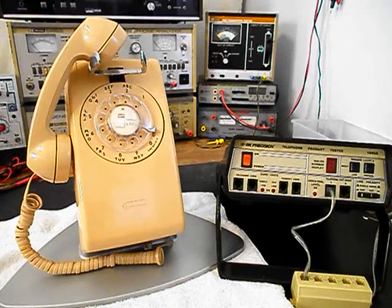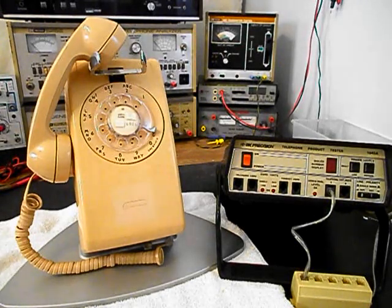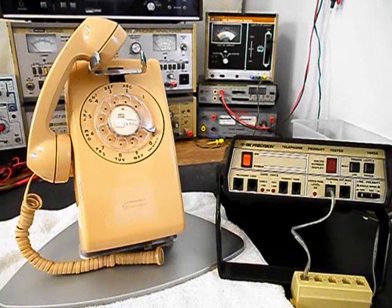We also want to install a switch for the mechanical bell. We will install a switch at the bottom of the unit so Curtis can turn the mechanical bell off and on. We will be setting the bell up for the most ring action. We also need to install a modular line port on the inside of this unit so that Curtis can plug in any length line cord, any color that he chooses, and plug right into the modular port — makes for a simple, easy plug-and-play connection.